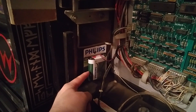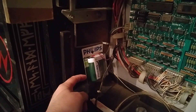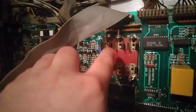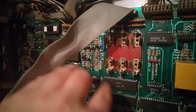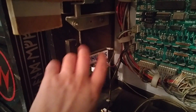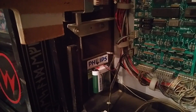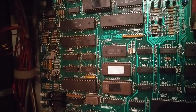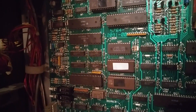It's a Philips long-life battery pack, still in its packet. They've basically just attached wires and put bolts through the old battery holder. That battery looks fairly over the top, but at least they've isolated it and put it out of the way of the board, so it's not going to cause any damage. I'm going to take all that off at some point, and I think we've got a soldered RAM — I'll get that RAM desoldered and stick an NVRAM in, like I do with all my games.